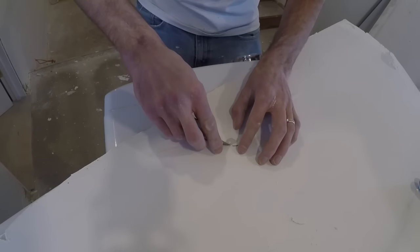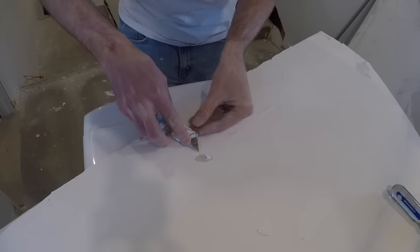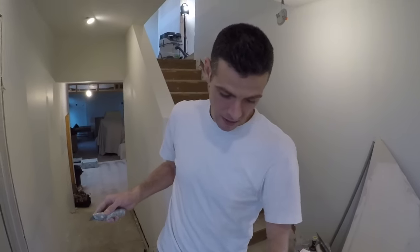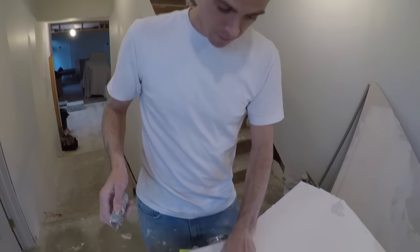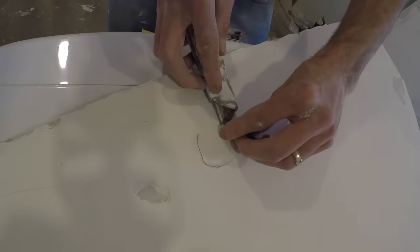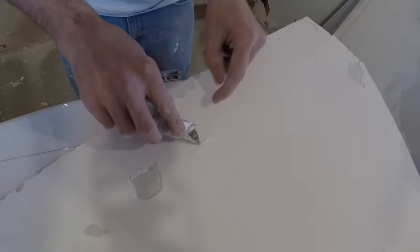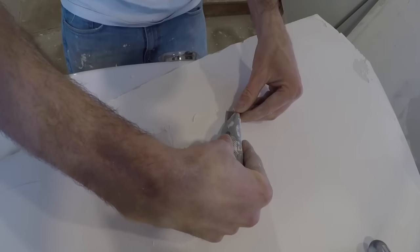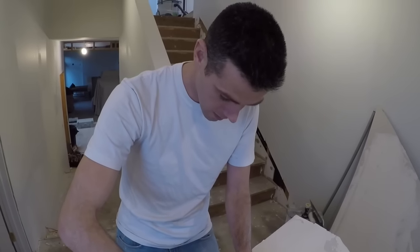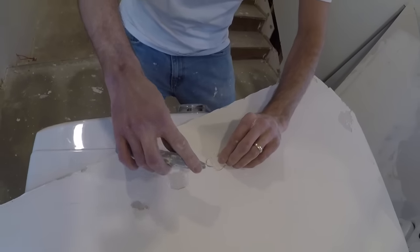You can do this right after you coat it and notice it, but you'll have to coat the whole joint again right away — or you can wait until the joint is dry, which is probably the easiest method. Once that's taken out, if it's just an isolated spot it's no problem. If you've got this all over the place, you've got to start over. I'm being very gentle because I really don't want to score the drywall very much. If I cut the drywall a lot I create a weak spot, but with the amount of mud covering this it's very unlikely that tiny score will ever crack or show up later.